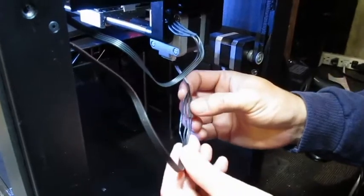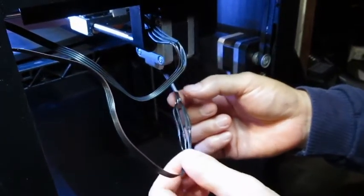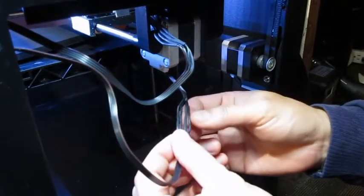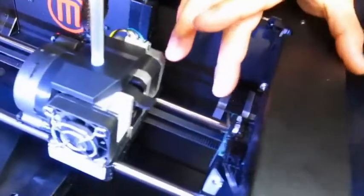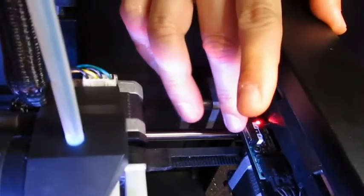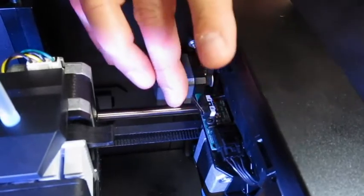So the deed is done. We've cut out the two damaged parts and then spliced them together just one to one — soldered with heat shrink on top. I did that to both sides. Now when I press down the limit switch, the LED always goes on. I'm going to hold that down while I wiggle the wires that go to it. No problems now — it just stays on.